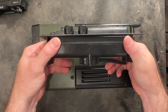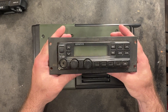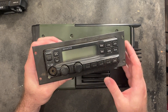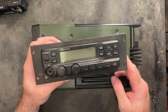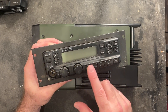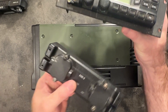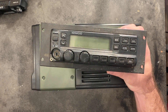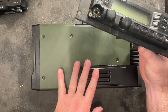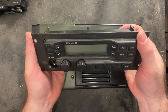One really cool thing with this radio is it can be used with a remote head. All the buttons on the control head are fully programmable with the software — they can literally do anything, including controlling up to three different relays with this model. So if you had this mounted in a vehicle and you're electronically inclined, you could use three of these buttons for turning on light bars, light pods, or anything else right through this one control head. You'd mount the remote unit onto the head of the radio with a cable running up to it — this thing is so big you could mount it underneath your seat, behind a seat, anywhere in your vehicle, and then just mount the control head.